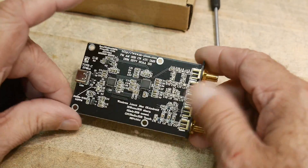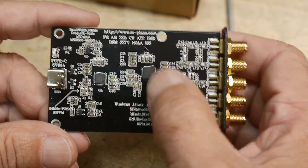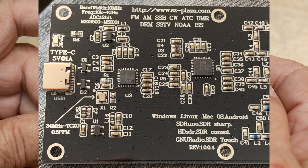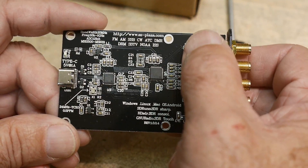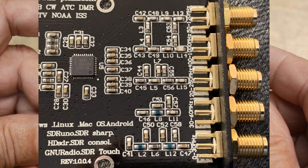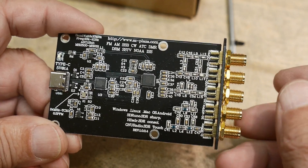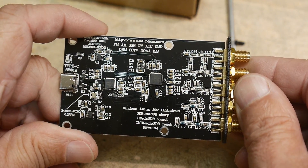There's nothing at all on the back side, so zoom in here. Two ICs. There's a little power thing over here, probably just a 3.3 volt regulator or something like that. That's it. It just has RC and LC filters so that you just reject any out-of-band stuff, so you don't get any spurs on particular bands that you're interested in. Otherwise, it just does everything in software.